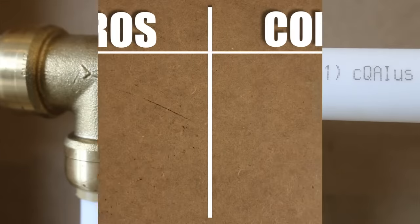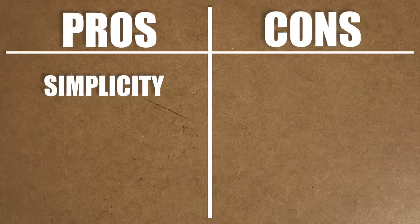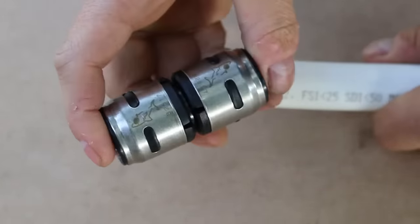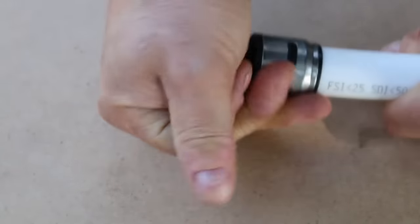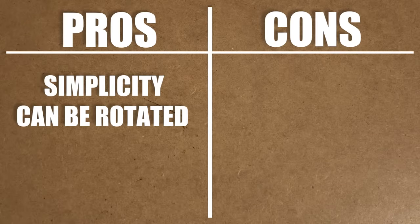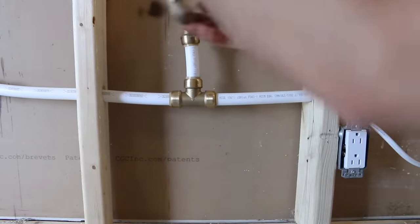Let's jump into part 3: the pros and cons. I've made a chart with pros on the left and cons on the right. The first pro is their simplicity compared to other systems — it's super easy to teach someone new to these as opposed to soldering, which could take months to master. SharkBite also just released a new product called EvoPEX, which shows a green indicator when the pipe is completely inserted, saving you the step of marking the insertion depth. They're basically foolproof. Secondly, the fittings can be rotated after they've been installed, which makes any adjustments a lot easier and quicker.